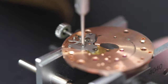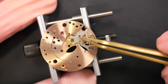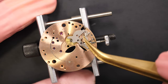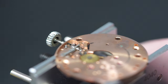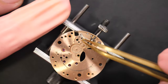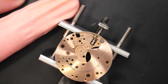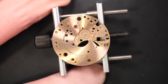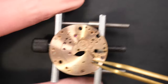Just unscrewing the setting lever screw and moving to the dial side. We're going to disassemble the keyless work, and you can see on the dial side it's pretty simple - there is only the keyless work, and it's pretty standard for an Omega watch, not many parts. On my channel I'll put a link in the top right corner for the Omega Speedmaster Mark III, where the movement is a lot more complicated with many more parts, especially on the dial side.